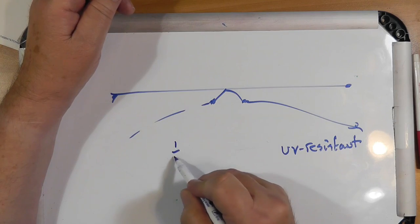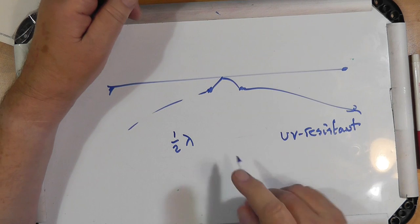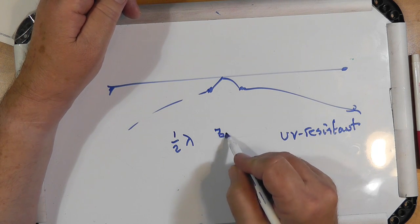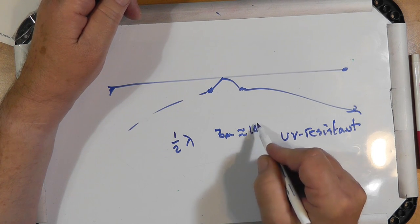Another thing that may work a little better is to create your own 6-meter dipole. Again, it's only 10 feet. The optimum height for a dipole is a half wavelength — it gives a nice simple pattern, single lobe, without splitting energy between the two lobes. A half wavelength on 6 meters is 3 meters, which is approximately equal to 10 feet.